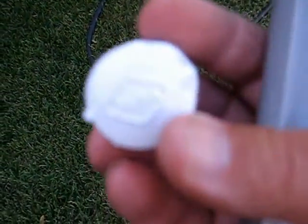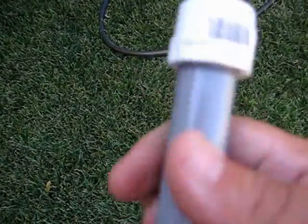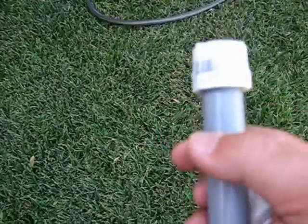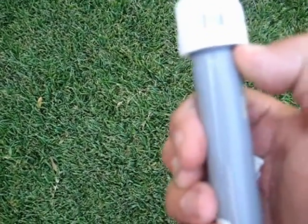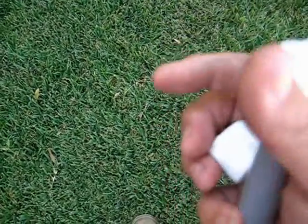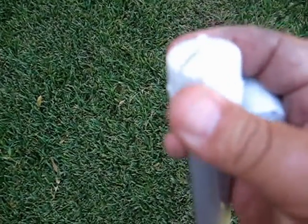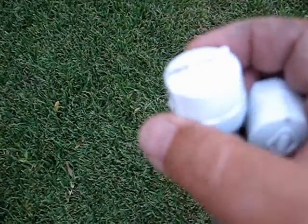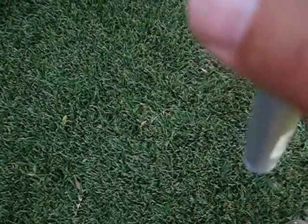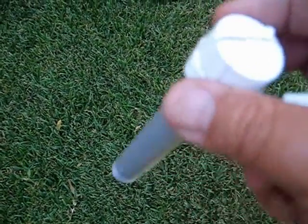You can see there, this is a cap, which would normally just cap everything off. What I did was I mounted the cap against one of the risers and put it in the vise on the workbench. That allows the vise to kind of bottom out here. Otherwise, if you try and clamp it right around here, you're going to have trouble with it moving around. And with that, I managed to cut a slot in the top. Trying to cut a slot on anything round can be difficult, but if you can bottom it out in the vise, that'll help. So now I have a nozzle, and I have a backup cap just in case.